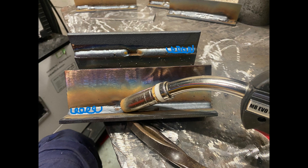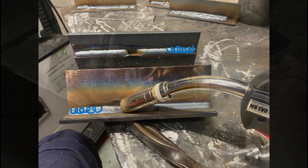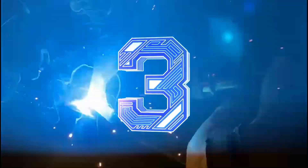From this image, this is the sort of pattern we're doing, both pushing and pulling. So we're now going to move on to the tricky part of the video. We're going to do a fillet weld, but on a T fillet joint. We've got no guidelines at all now, so we've got to be really consistent in our mind where that bead width is going.